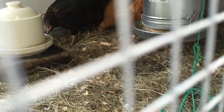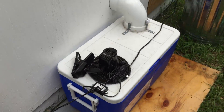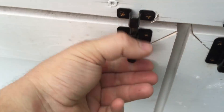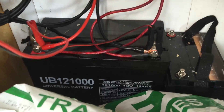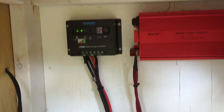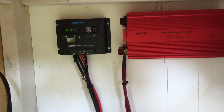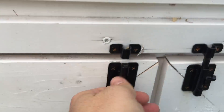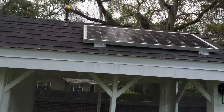That's the solar AC system in a nutshell, all running off solar power. I'll show you one more time what it's running off of — that's a 100 amp hour battery running up to a PWM solar charge controller. The power inverter is not being used; it's just running off 12 volt, and it's getting all of its power from the sun.